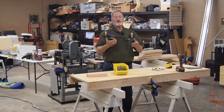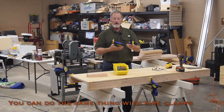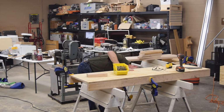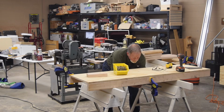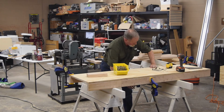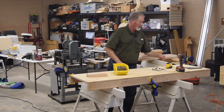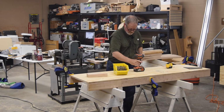If you've got one of these clamps, you can turn it around. This side is ordinarily on that side, and we use these things to grip, but they also separate. And of course I don't have enough room here, so I've got 2 2x4s underneath, and I can take this in the middle and expand this out and push this board into square. It's a little too much. All right, that's looking good there. That's looking fine. So at this point, with my marks made, I can set the screws and I can hold him in place.